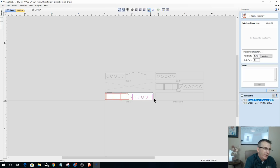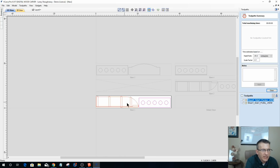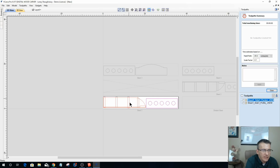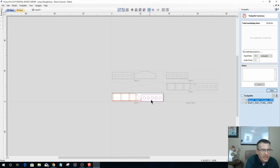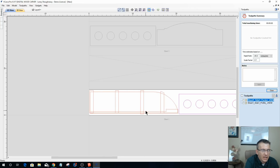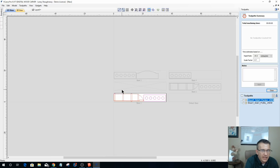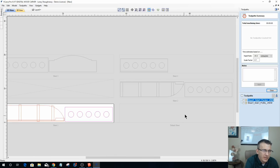All right. So what I'm gonna do is I'm gonna just cut these boards down to a certain length, and I'm gonna run each of these pieces individually, because these 3 shelves are 100% identical, right? So one set of tool paths will do all 3 of them, right? My pocket cut here and my tool path that I run for the top piece works for all of these pieces. So here, let's do this.